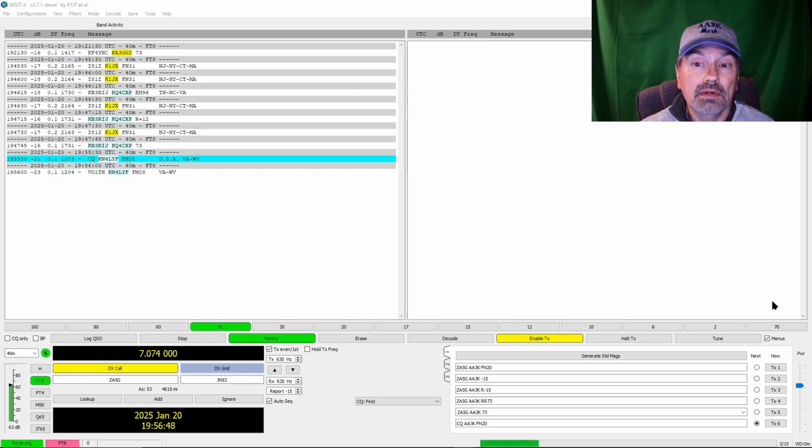And the next thing you want to do is set the audio level drive to the radio so you don't drive the radio too hard and distort the signal, cause spurs, emissions, and harmonics within an intermodulation within the FT8 signal. So on your FT-817, set the meter to the power output indication, come here to the power slider on WSJT-X and reduce it all the way to the bottom of the scale. Now I don't want to change this setup because this is being filmed here on my home station. And then slowly increase it while you're transmitting, and watch the power output meter on the FT-817, 818, and when it just hits full scale, stop. And you may want to back it off just a tiny bit from that point, and then you will be properly set. Now I've only done this with my radio at 5 watts, but if you'd like to run the 817 or the 818 at lower power, that should work.